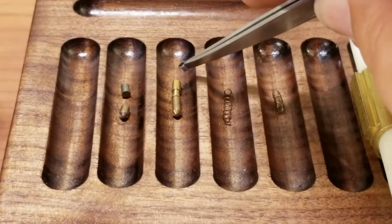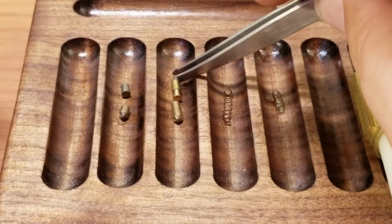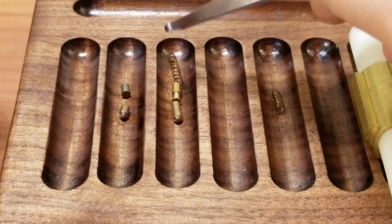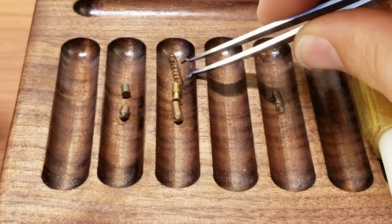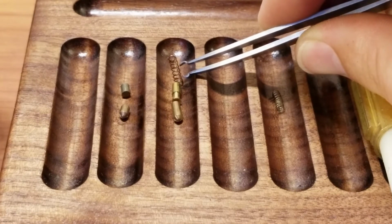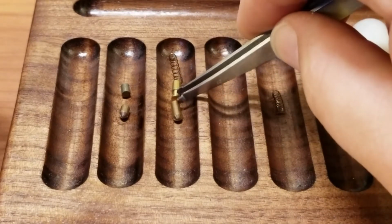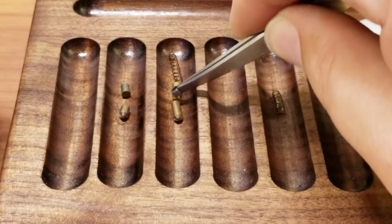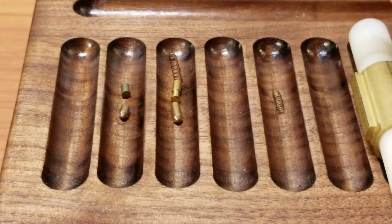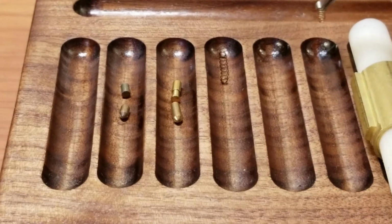as long as you take into consideration that with your spring taking up extra space, which I'll set one up here, when that spring compresses, it still takes up about that much space, about how far I got my tweezers spread apart here. So I'd say that's just a little bit over 1/8 of an inch. And I have a feeling that this is still going to want to ride below that shear line. You may not even be able to get the plug back into the Bible with that setup, if it is too long.